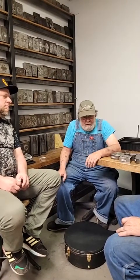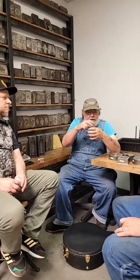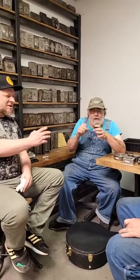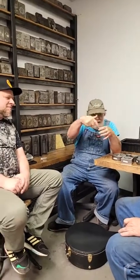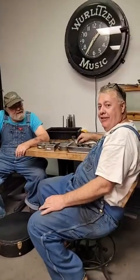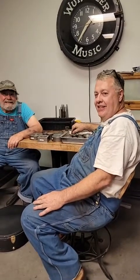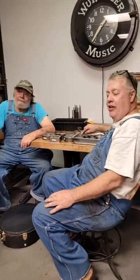Kevin's doing one now with a very deep-relief head on a figure that's off-center. You can't just use a straight cone because it won't get into that really deep recess off the edge. So the normal method of more tonnage doesn't work. We joke that we need a thousand-pounder, but it's opposite of what we tell customers — it's about technique, not tonnage.